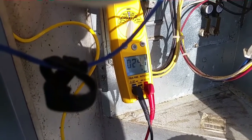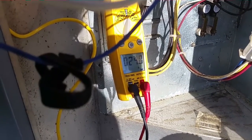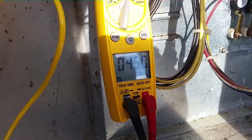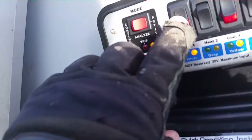Still have 5kW, so we're going to make sure that turns over to 10kW here in a second, or else we'll investigate what's going on with the heat strips. As you can see, both sets of heat strips are running right now, so we're good to go there. I'm going to turn those off and make sure they drop out.